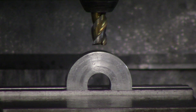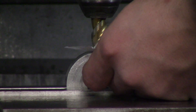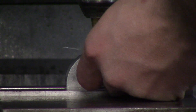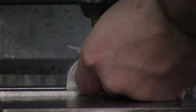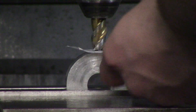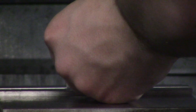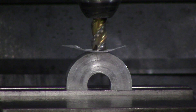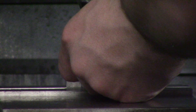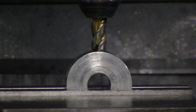You might not be touching off at the high point of your tool. What I like to do is come down and touch off like I normally do. Once the paper stops moving, I'll come up probably two or three clicks and then start to spin my tool. If I feel it grab — like it just did — I'll come up two or three more clicks. It keeps grabbing, so I just keep coming up until it runs fairly smoothly over the paper.